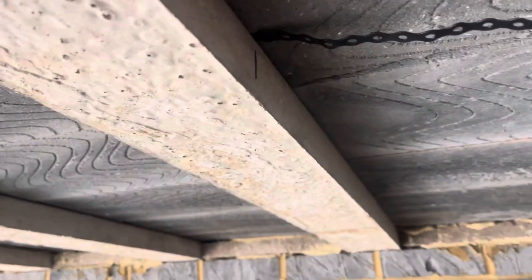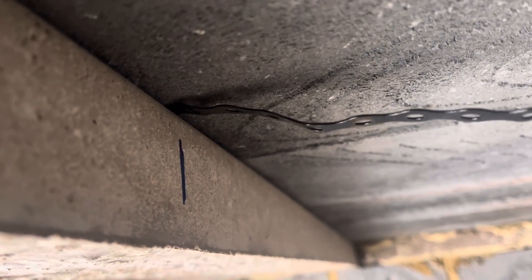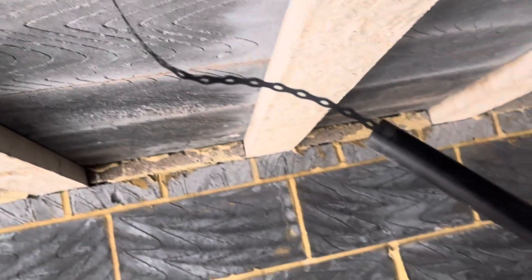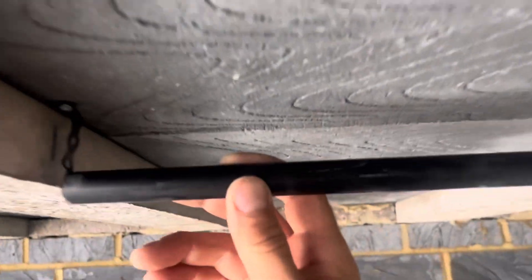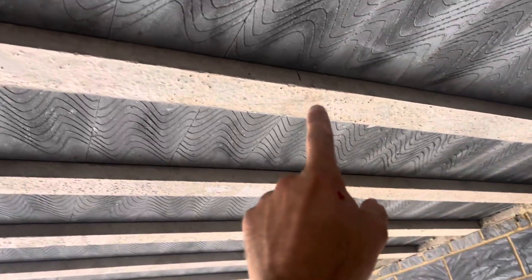My plan is to get this banding in so I can get it underneath like so, and then put a screw in to hold it up. Then I'm going to feed a bit of 20mm conduit onto it - that is my plan to run the cables over there. With a bit of banding I can run all the cables; there's going to be plenty of room along there for my lights and the sockets. I'm going to go all the way along - I've marked each one where I'm going to do it. There's quite a few to do, let's get cracking.